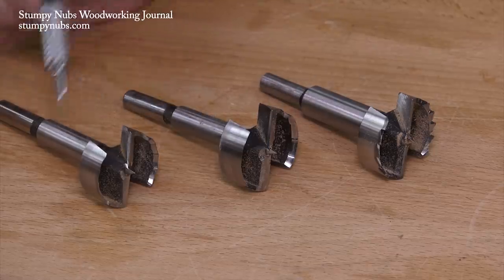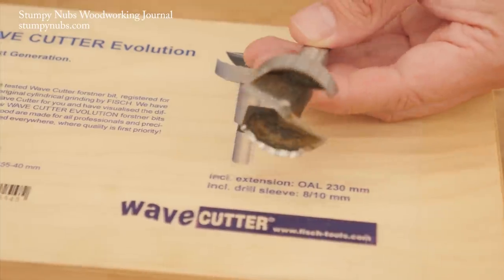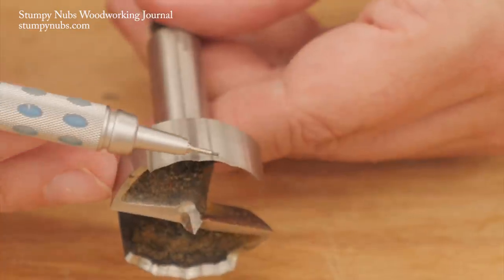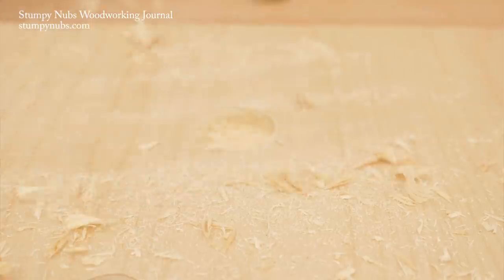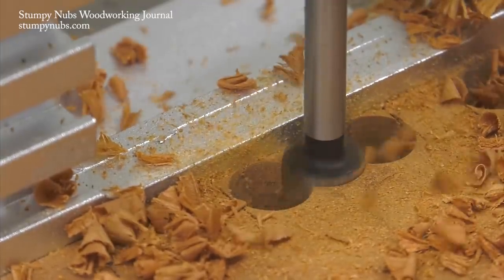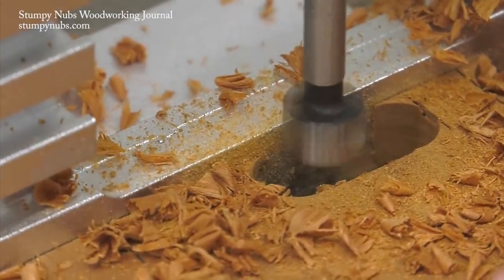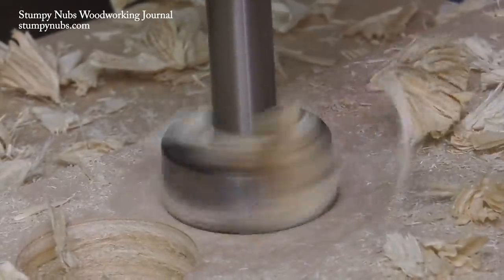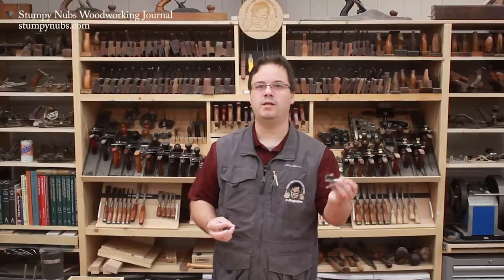We have an entire video about the different Forstner bit styles, so I'll add a link below and just give you some highlights here. Much like a spade bit, a Forstner bit features a point to begin your cut. The rim around the perimeter severs the fibers around the hole and guides the bit during the cut, while a pair of cutters in between remove the bulk of the wood. Forstner bits are prized for their clean cuts and the flat bottoms they leave in holes. They can also be used in a drill press to bore overlapping holes for removing waste in a mortise, and some work well at angles as long as that angle isn't too steep. Quality matters — very cheap Forstner bits will cut poorly when new and only get worse because they are poorly milled and heat up quickly. Heat is the enemy of any bit. Because a Forstner bit does not have chip-clearing flutes, you must periodically lift it from the hole to allow chips to clear, and you must adjust your speed to match the size of the bit.